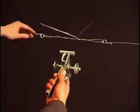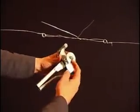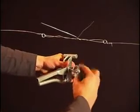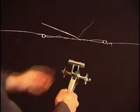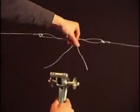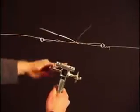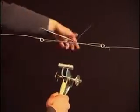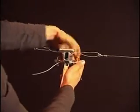Hold the tool so that the head faces upward, exposing the cogwheel inside. Turn the disc's specially cut notch so that it appears level with the handle, facing towards you. Load the wire ends onto the Cortool by crossing the two legs over the angular nose of the tool, and fasten them at the notches.